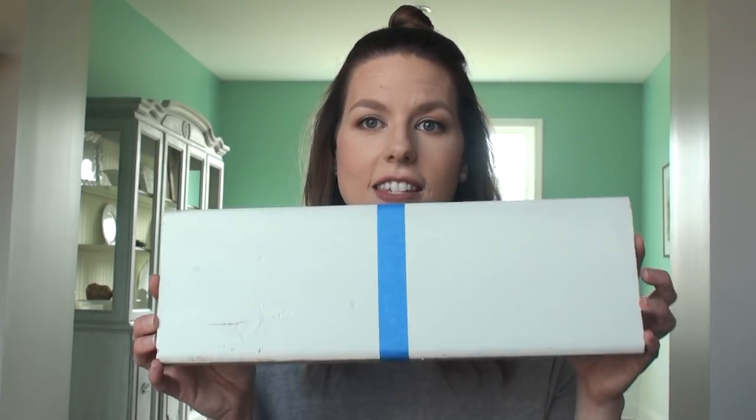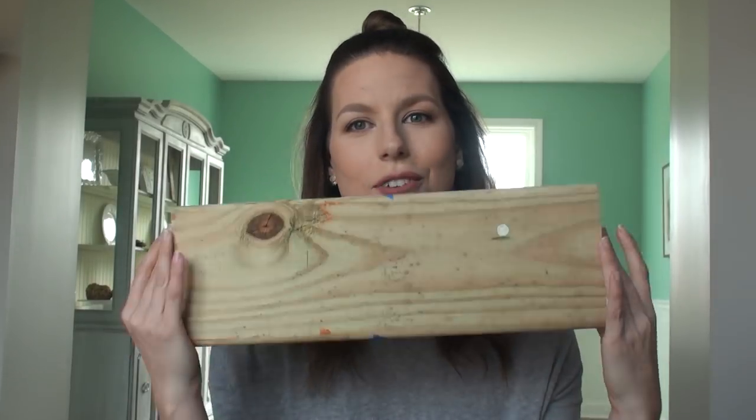I've already taken this unfinished board and painted it with Annie Sloan chalk paint in one of my favorite colors, Old White. The reason I really like using wax is that it doesn't yellow or change the color of the paint — it deepens it a little but definitely does not yellow, which you do not want with white. I've worked with some clear coats before and they tend to change the color and yellow it a little bit, so we're going to see what this one does today.